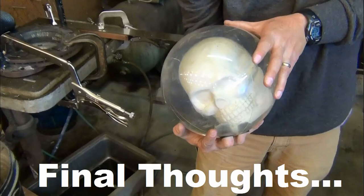Here are some final thoughts on this project. First, I didn't need to clamp the ball in place before clamping the square ruler — the reason I did was this was a free ball with a hole drilled incorrectly that I had to plug and cut down. If I were just drilling a fresh ball, I would set the ball in place, clamp the ruler, and then move the ball. Second, when I clamped the ruler down I only used one clamp. In the future I'm going to use two clamps — I think the reason the forward and reverse were off a tiny bit was the ruler must have moved.